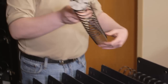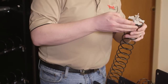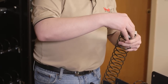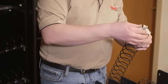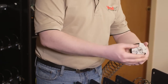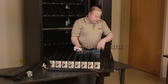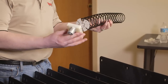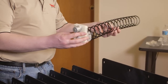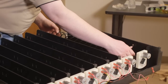Each auger has a gray auger coupling that connects it to the motor. To remove, simply twist and pull loose. To reinsert, slide in, follow the tab, and slide underneath the black connection. To reinsert the auger, secure it and verify the auger tip is at the proper timing, usually 6 o'clock. Insert the auger coupling into the motor. Insert the motor down, verifying that the auger coupling is behind the ledge.